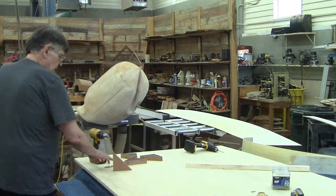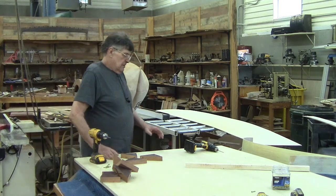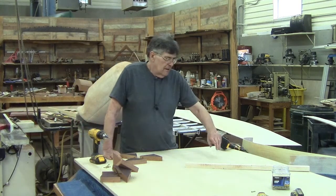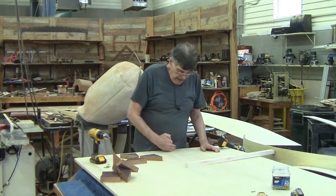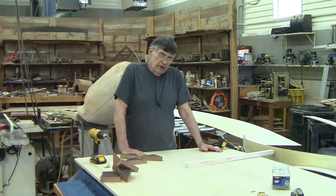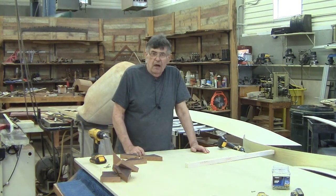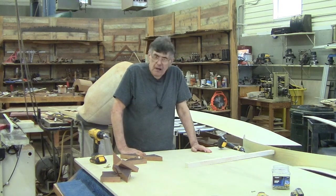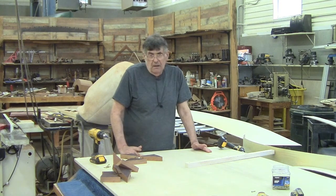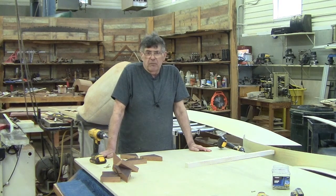Before I go too far, here's what I did. Made me a custom compass. Here it is. Now, the apron's got to sit back. But in order to do this, whatever the thickness of your apron's going to be, plus the thickness of your plywood, which will be your base core, you've got to compensate for that. You understand? So if you're going to do a 5/8 apron, then you've got to go 5/8 plus 3/16, not a quarter. I'll show you why in a little bit.